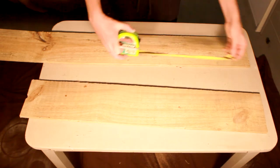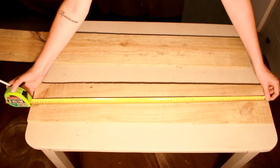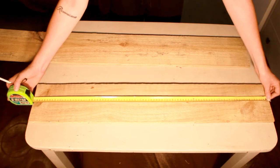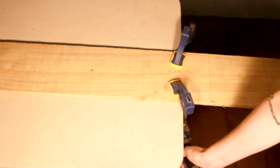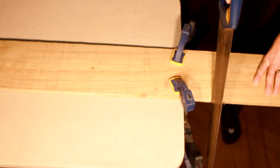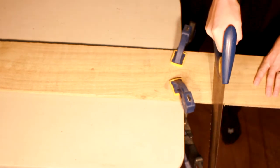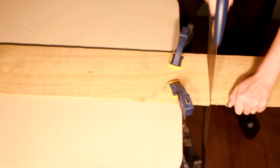The type of wood I have are fence palings — perfect for this kind of job because they're treated for outdoor use, so it doesn't matter if they get wet. The width of my bath is 100 centimeters, so I cut two lengths of wood to 100 centimeters, clamped it to the table, and used a hand saw. Super easy.